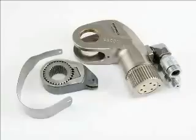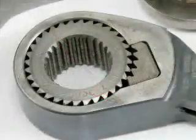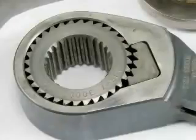Remove the crank assembly. Remove the ratchet, spring-loaded drive shoe, and compression springs. Clean and inspect for damage. Any damaged components and seals must be replaced. Dry all components and apply a thin coat of molybdenum disulfide to the locations as shown. Do not apply any lubricant to the ratchet or drive shoe teeth.